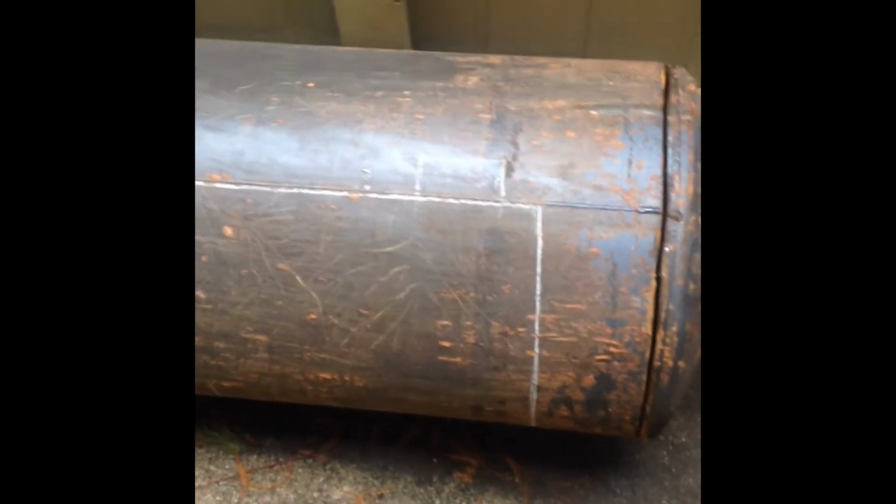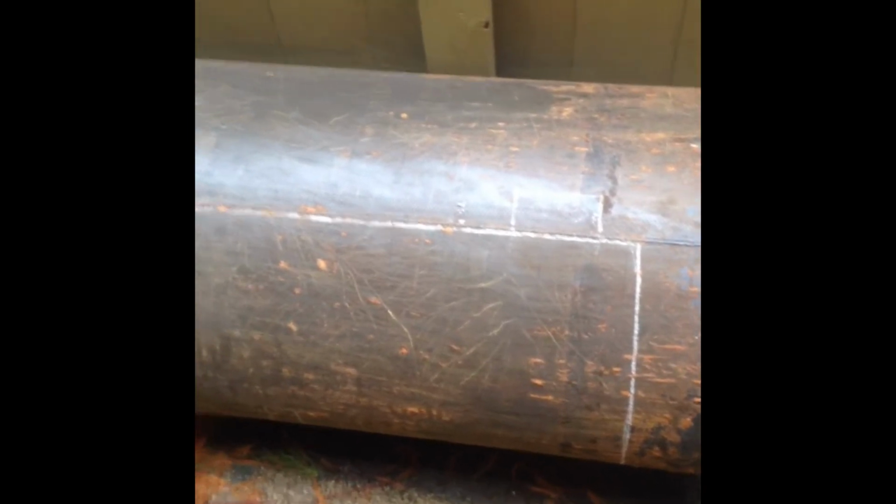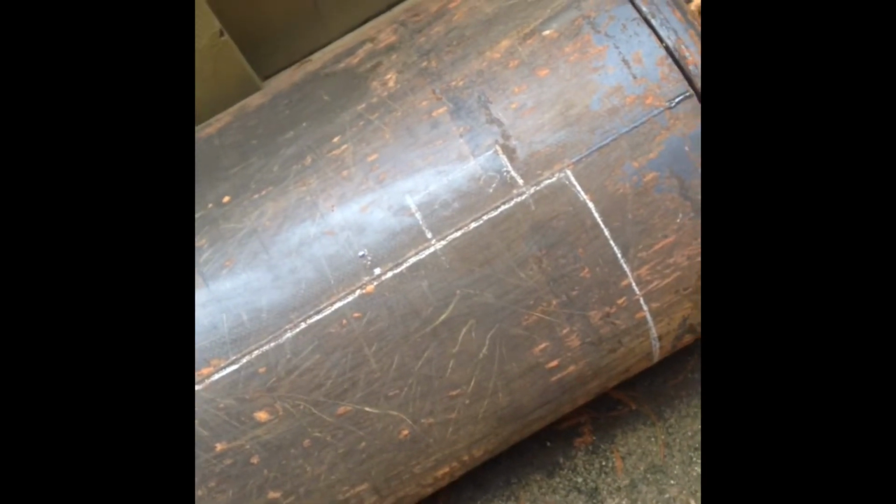And I made a clip just for the heck of it that was like, don't just go cutting into anything, stuff like that. But then I came right here and had this happen. So that's pretty much an all around done deal, project over, redo. But for the heck of it, don't go cutting into just anything. I know I had a hot water heater, so everything was fine. If you get like a mystery container, don't just go cutting into it. Fill it up with either inert gas or water, then cut into it. But you really don't want to mess with it unless you know what was in it beforehand. So just don't.